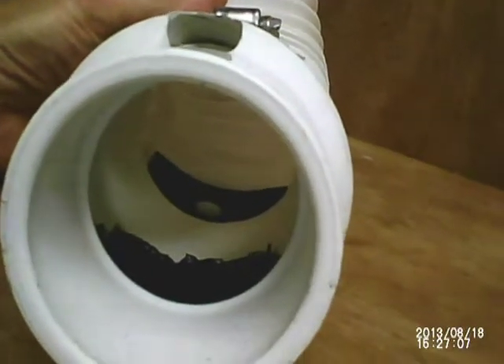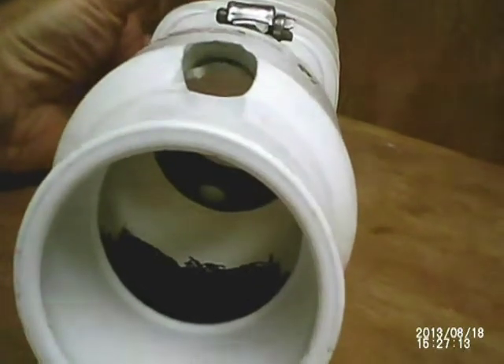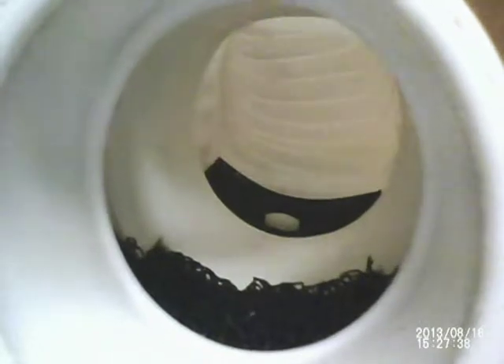To cover the prospect and possibility of losing fine gold, I've modified the coupling and placed a small piece of miner's moss in there, and also further down in the concentrator, some ribbed matting has been installed in the bottom, so that as all the material slides along, any gold that's in there has a greater tendency to get trapped. That's what it's going to look like.